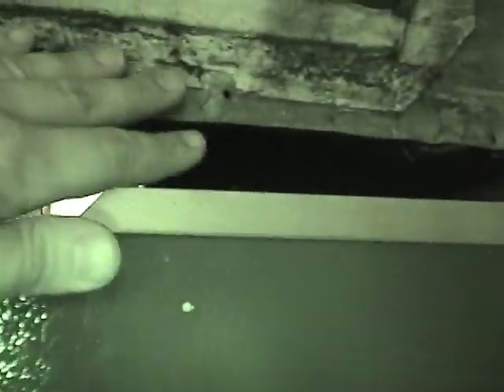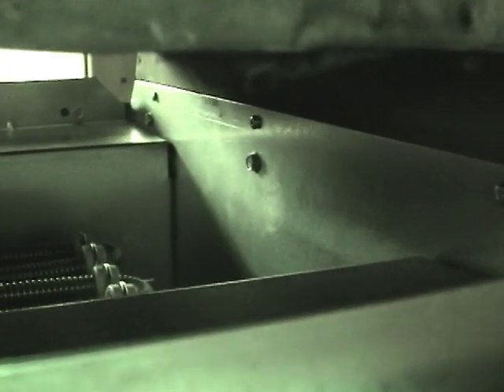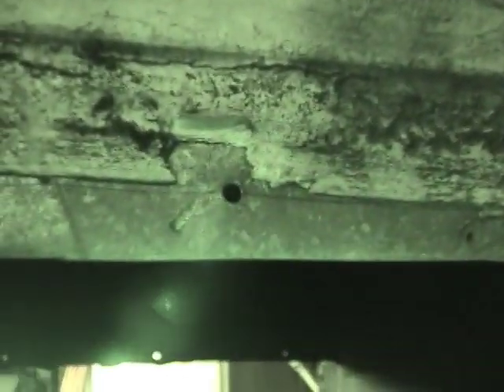Here's how we're adapting the duct. The back end just screws straight on. The sides are going to have some adapter panels. The other one's going to go up here and across, and some others on the outside. I'm not too worried about the duct size difference because the actual exhaust from the fan up here is much smaller than the original duct, so having this cut off here shouldn't be a problem.